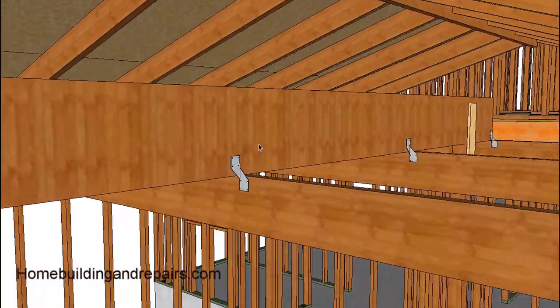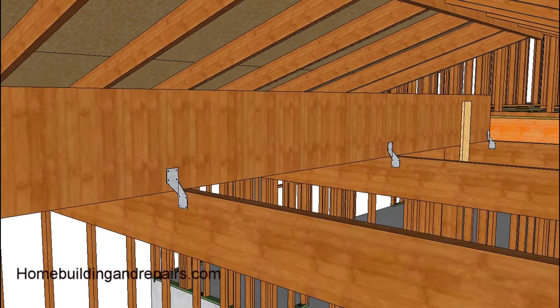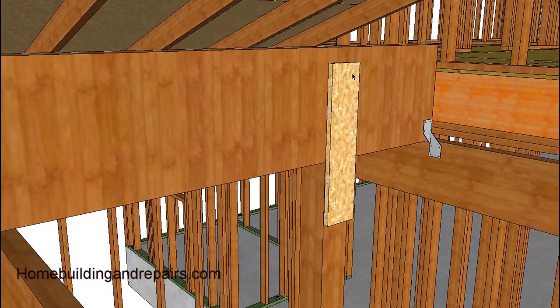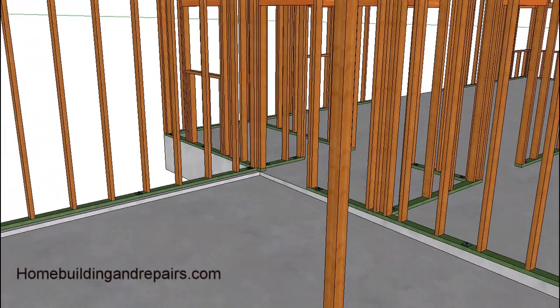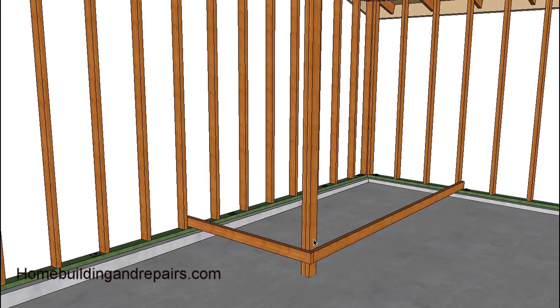You can use hurricane ties to attach the beam to the rafter ties or ceiling joist. You can use a piece of plywood or scrap wood, nail or screw it to the post and to the beam, so you can take the screws out and remove the post. Whether it's attached to the beam permanently or the post permanently, you can simply unscrew these and remove the post and get back to having your two-car garage. If your posts are a little flimsy and moving, you can always brace them off somehow.